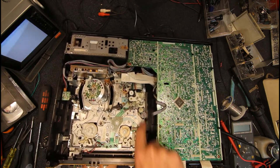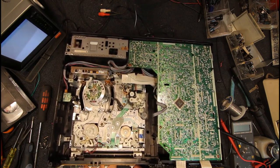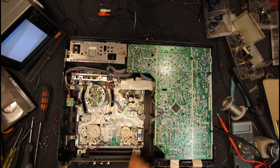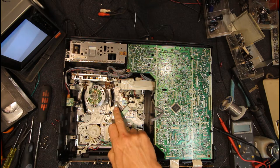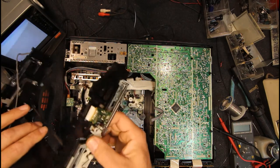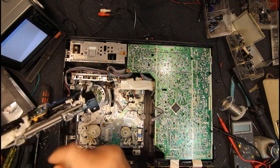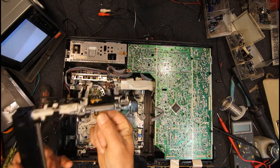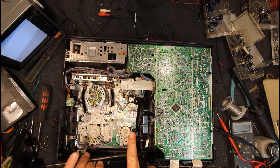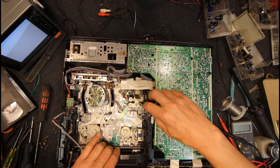Now I need to get this gear back into position, which is when those little arms, the first stop point, basically those arms come out. So you'll see that little slotted bit is back over here. Got these arms out, so we can grab our loading mechanism and just make sure this bit's pushed home, it's not up at all. Make sure that first tooth, you can see it under that hole there, like a little sight. Whoops, as soon as I touch anything that moves up, so I've got that little sighting thing there. And it's a matter of just lowering it back in.